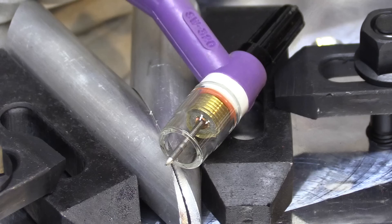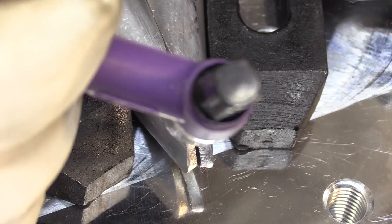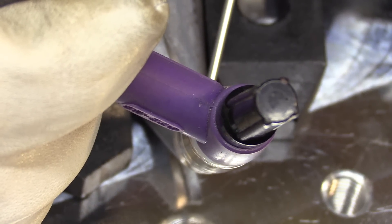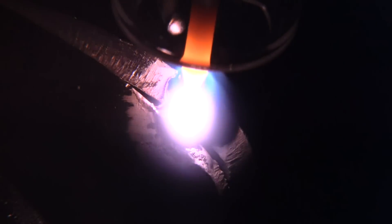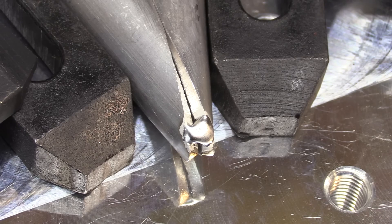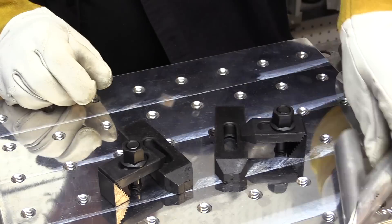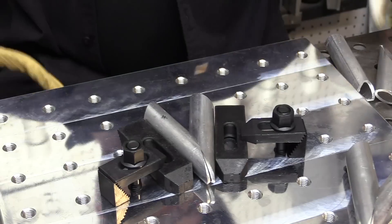I'm using a number eight Furick Pro cup for this video — it really helps with filming. I figured if I just get one tack on all of these pieces, I'll be able to move them around and tweak them a little bit so they fit. When you tack everything together, you can definitely get an accumulation of tolerances if things are locked in — you'll have to wind up cutting tacks loose. So I'm putting one single tack on each one for now, and if I need to tweak them I will. See — that next one just slams right in there and holds itself while I get the single tack on it.